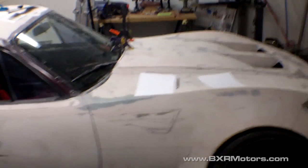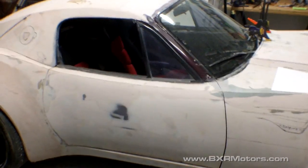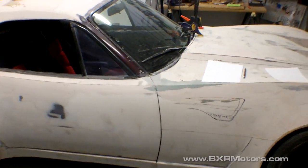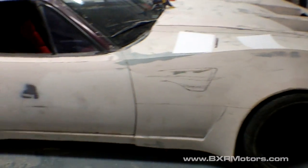Basically what I did was take a CAD file — the creation I made in CAD — and sliced the car up into several slices. About 130 slices in one direction and another 60 or 30 the other way, ending up with about 200-plus sections of the car. I then laid those sections out on a level platform, filled the space between each section with foam, and carved that foam down to meet the profile of each section, giving me the car's shape in a pretty solid format.